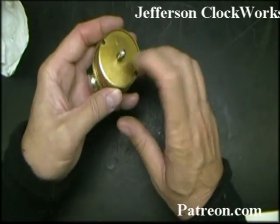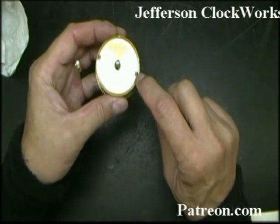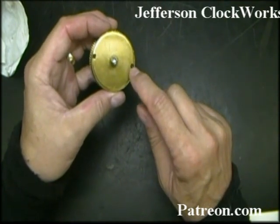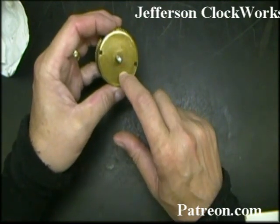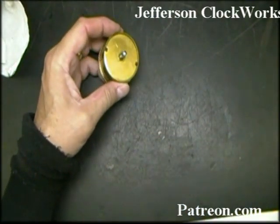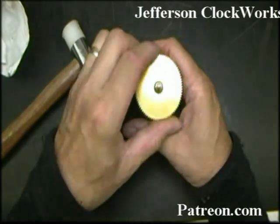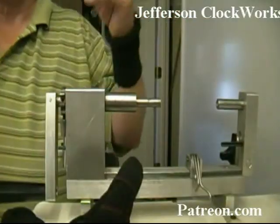We want to take the spring out of here. The first thing we need to do is take the cap off. The worst thing you could ever do is stick a screwdriver through that little square and then torque it up — you damage the end of the barrel, damage the cap, and might fracture the spring. These little holes are put there so this little cap can flex and go back on without trouble. So don't think those are access flats. All we need to do is pop this guy up — simply turn it over and it's out. That's the correct way to do it.